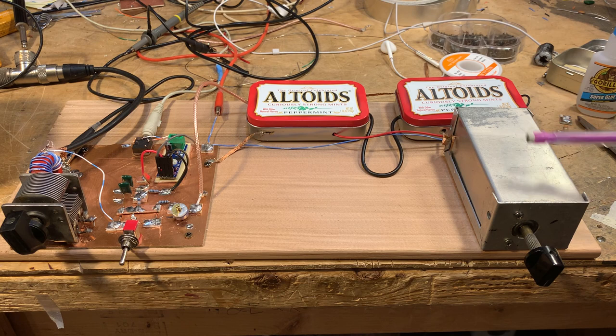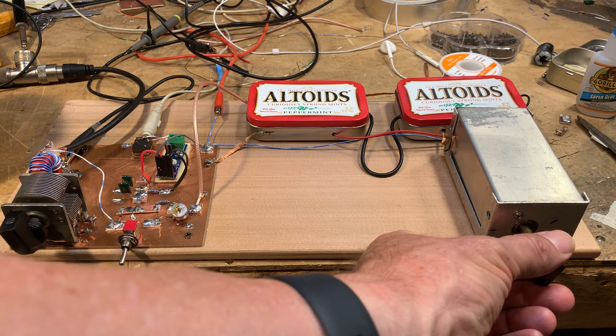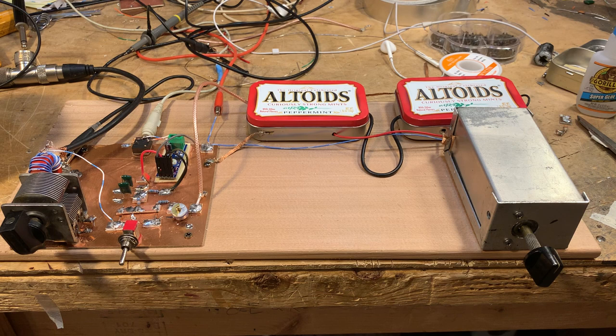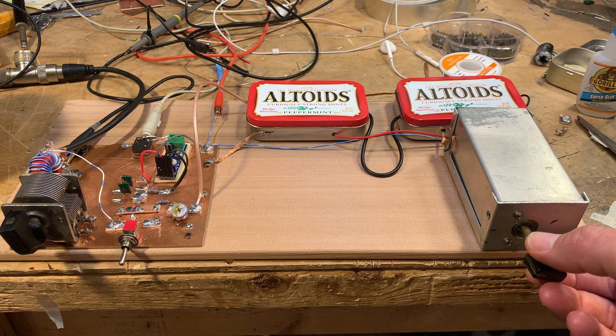I'm using an air core coil. This is an Armstrong oscillator, and I've separated out the amplifier stage as well. Other than that, nothing fancy, but it works really well. One of the contributors to stability is the fact that the VFO frequency is lower. You're not hearing it drift very much at all — really nice. Three cheers for Vlad Polyakov.